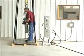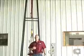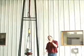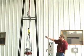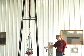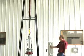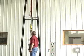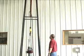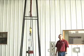I'll pick it up a little to make sure we have a balance at halfway stroke. We have a four-foot cylinder — we can see two feet stroked out. If the weight of the single joint elevator and pipe is a little heavier, you can just add a little more regulated air to get it where you want. That's about two feet sticking out of the bottom of the rod.